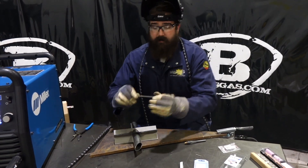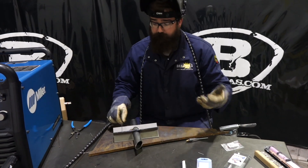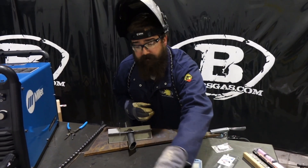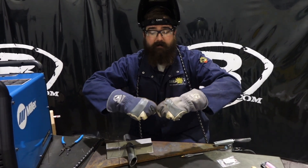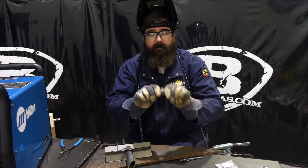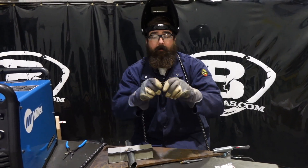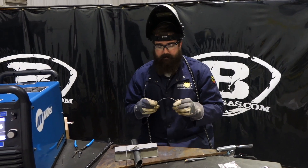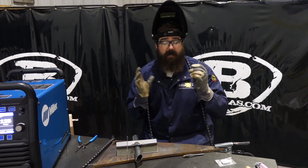What it is, it's annealed europium mixed with tungsten, and that causes it to be flexible — like this piece right here. You can see we've bent that piece, and we'll bend it back. You have to be careful when you bend it back; anything that's annealed will work-harden and it'll probably break. But you can see it's very flexible — not common with regular tungsten. If you had regular tungsten, that stuff would have shattered right away.